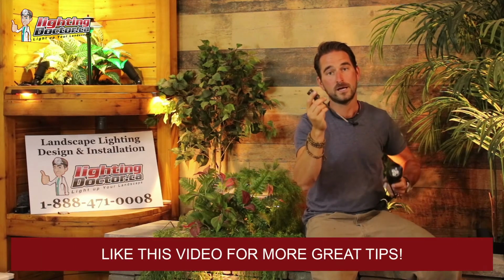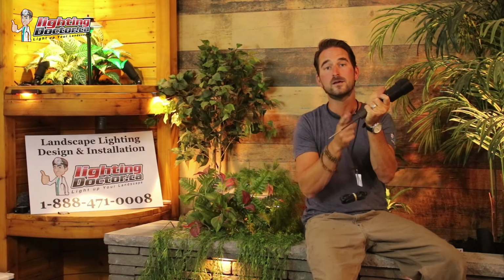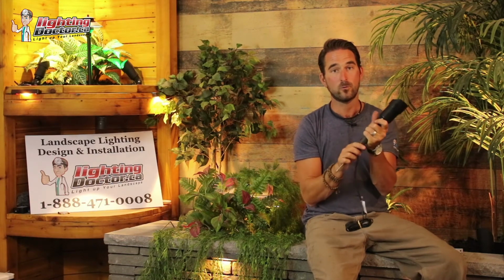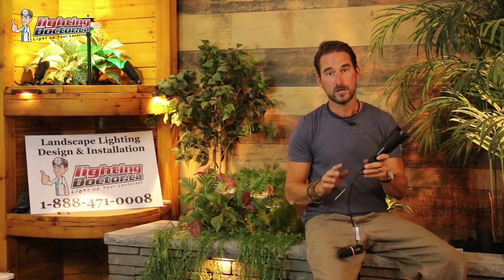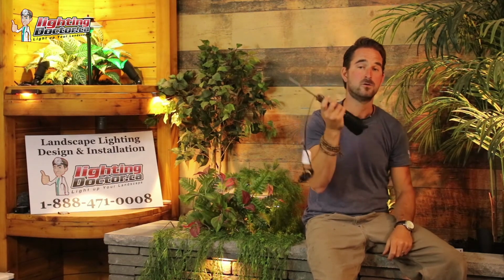They have a giant screw end on them that simply screws into the tree, and then you can mount your light on the stake as opposed to a ground stake. So it's a super easy way to get it in the tree. It allows you to easily back off the mount as the tree starts to grow, so that tree never grows over your lighting fixture. So it's a great way if you need to mount in a tree and just keep that light off the ground, or if you're looking at doing some downlighting and you want to mount that up in the tree and have that light shining down, the tree mount stake is a great and easy option for that.